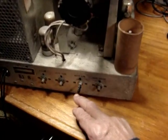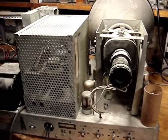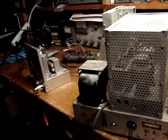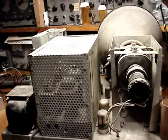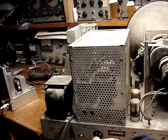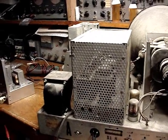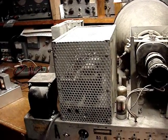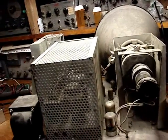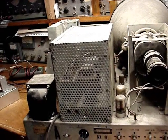Could it be that there was actually at one time raster and picture on this set? I don't know. Also, this set powers up from the radio — the short cord that came out of this connection, this plug, it's not a cheater-type connection but a larger connection, very much like my Zenith has on the back. This goes over into the radio, so apparently the power switch for the TV is in the radio part of the set.